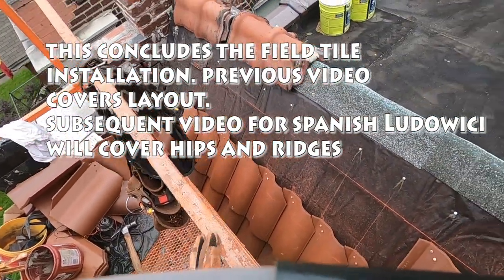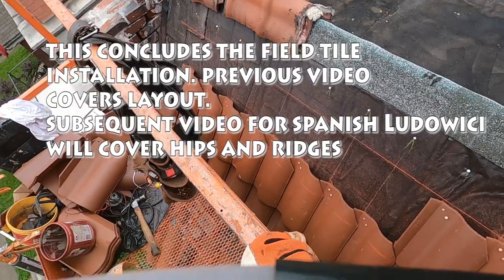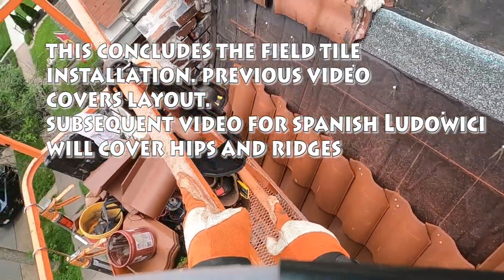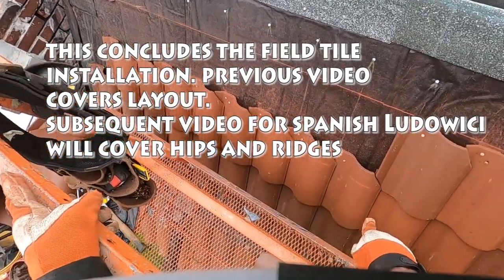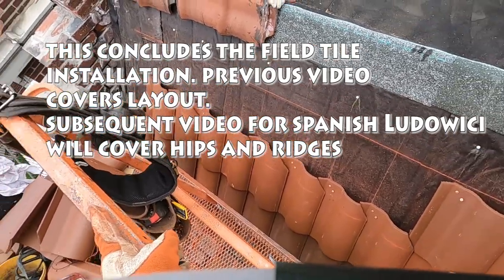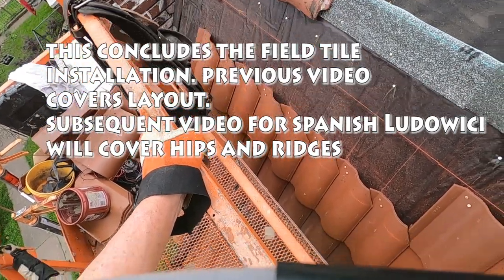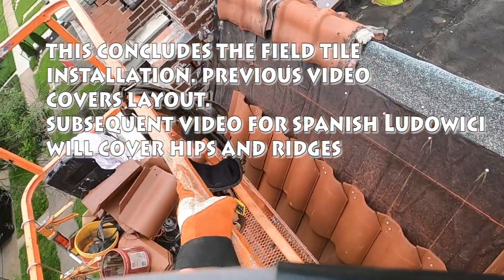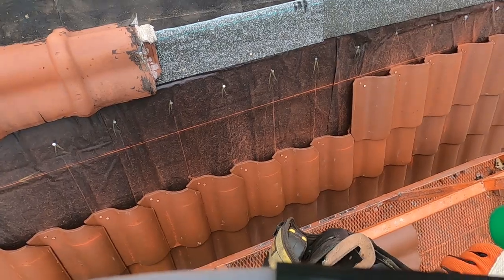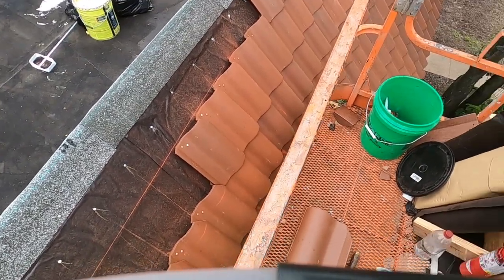But I just wanted to point out that I have to keep watching constantly for how the thing is going to turn out in the end. And there's no hard and fast answers. Maybe only a couple times before, I've chalked a line on the face of a tile. I've done it maybe once or twice on slate. I always chalk on the felt. But there's no rules set in stone when it comes to steep roofing. It's whatever gets the job done within the limitations of the manufacturer's specifications, such as a 3-inch headlap. Or in the case of slate, whatever headlap they specify, which is different for each width or exposure.